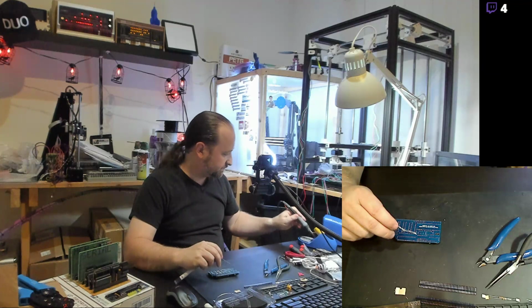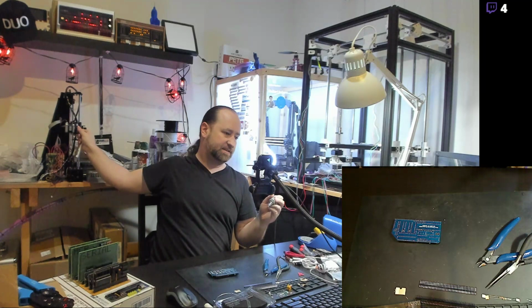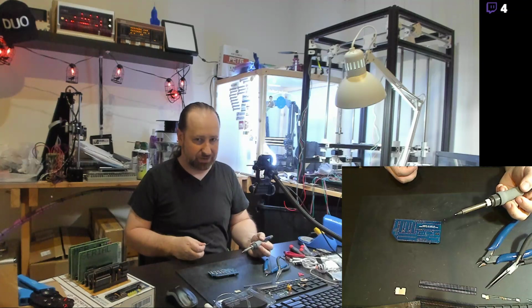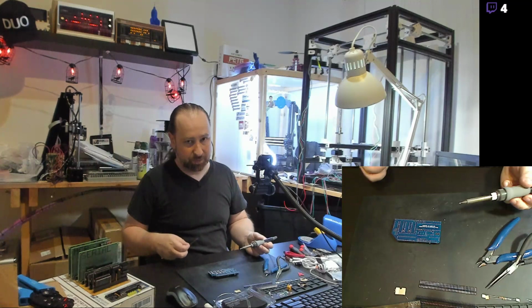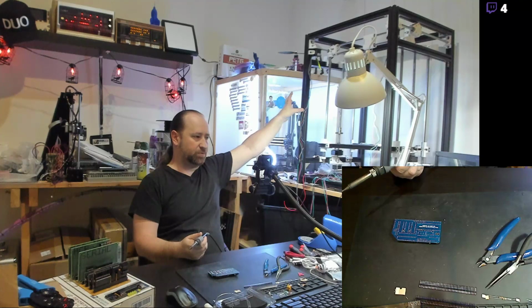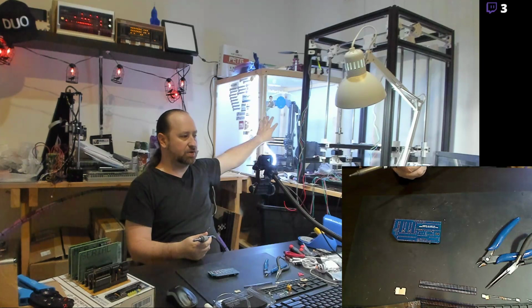Like this piece of crap behind me on my right, on screen left, this is a Tronxy X8 printer, which is like the ANET A8. The frames are made out of laser cut acrylic, and laser cut acrylic or any other laser cut plastic is not good for a frame. That kit was $150 and absolutely not worth it at all. Both of these machines here, obviously this one's a kit. This is a kit I've built myself. All of the extrusions, the rails, everything, all the precision mechanical parts are from Misumi. The one that's in here was a kit. That's the Mendel Max 3. It's all aluminum extrusion with some steel plate panels for the front and back.